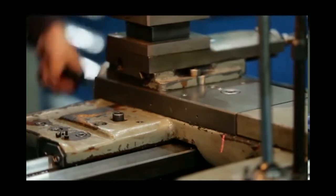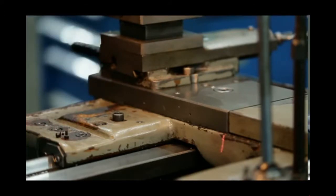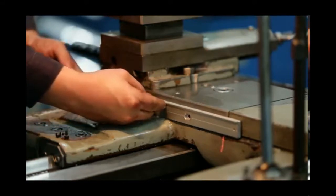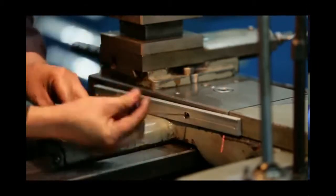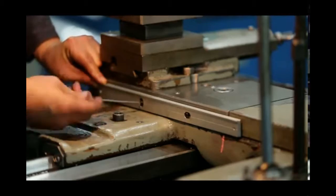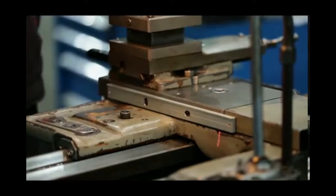The next step is to install the pad strips onto the carriage. First, turn the carriage to one end. Please pay attention during the pad strip installation: the top side of the pad strip should not exceed the carriage platform plane, and the bottom of the pad strip should not contact with the saddle. After installing the pad strip, we also need to check the parallel of the pad strip.